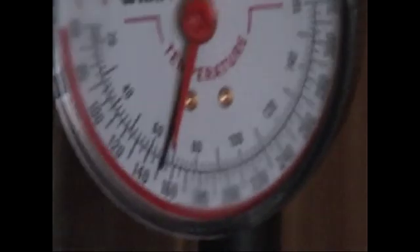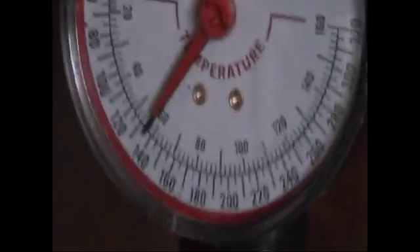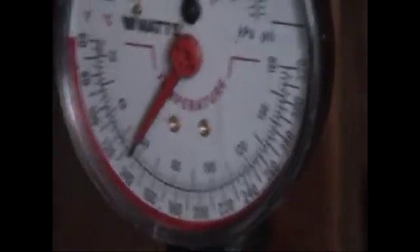I have the temperature set on my stove to keep the water temperature at 160 degrees out of the heat exchanger, with an average heat rise of 30 degrees from input to output, using a TACO 007 hot water pump purchased at Menards for approximately $100.